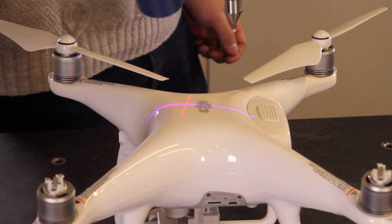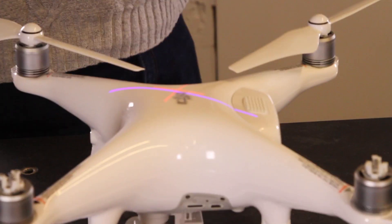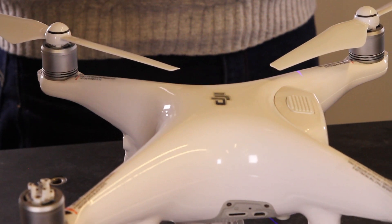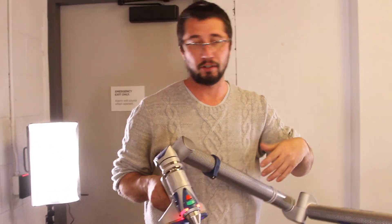The laser finds the distance, and the arm helps you keep it in place. The arm also determines positioning — it knows all the exact measurements. This thing is extremely accurate. In theory, I could scan my fingerprint with this. A lot of that accuracy comes from the arm, versus scanners where you have to place reference dots and everything else.